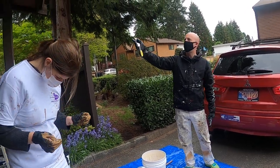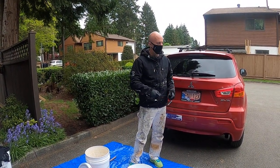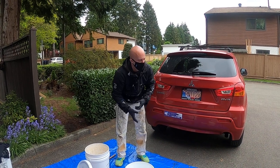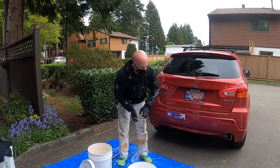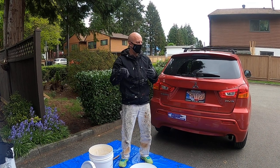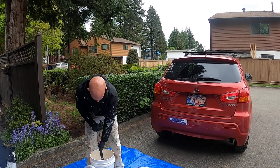But if we're using a white on the ceiling and that roller is still in good condition when I'm done, then I scoop out all the paint, stick the roller in the water, and work it back and forth — continually burying it in the water, then working it — to help get the paint out. Between rinses, stick a rag through to clean out any water inside, then stick it over the top of the spinner and spin it.